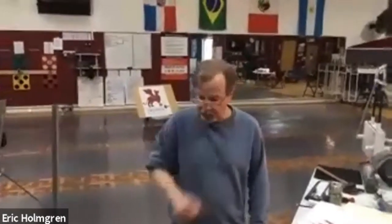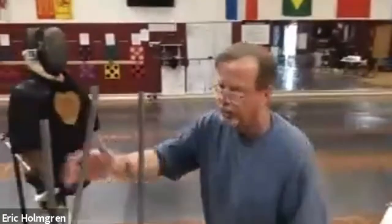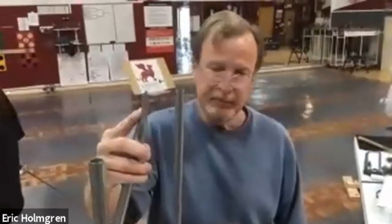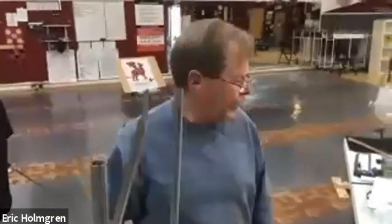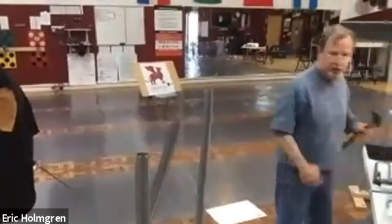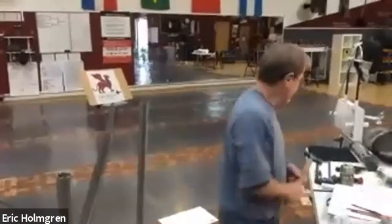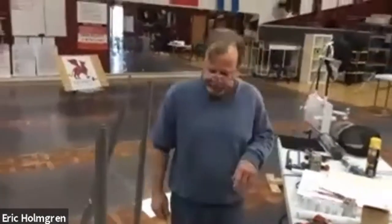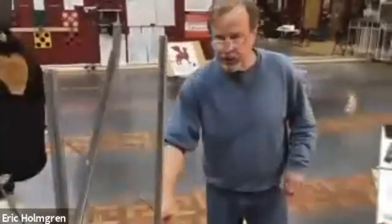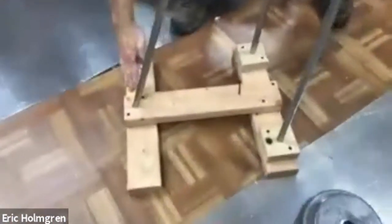The piece in the back is the back brace. I took the five-foot length, put one end in the vice, cranked it down, basically flattened it, and bent it at a very slight angle. If you don't have a vice, you can hammer it flat on your driveway. The tricky part is that the back hole in the back two by four has to be drilled at the same angle that the steel is going to go into it.